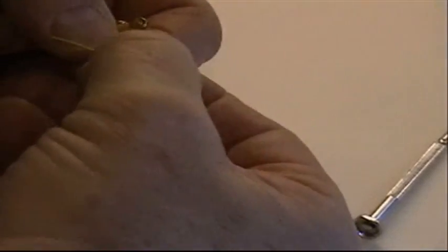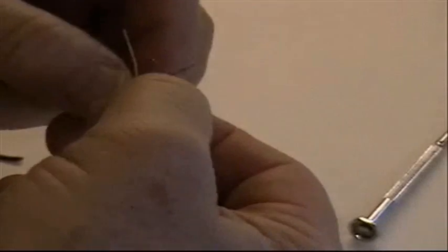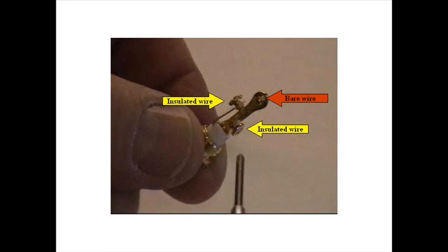Next, you want to pick up the plug and take a small Phillips screwdriver. That's the star type probably. Matter of fact, I'm sure it is if you buy the plug from Radio Shack. And you want to loosen each one of the little screws on the three different lug terminals. That is the connection points. Now after you do that, the job is to connect the wires to those screws.